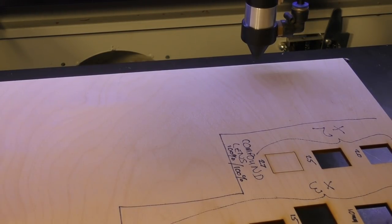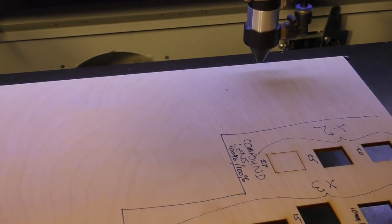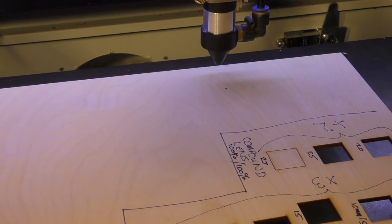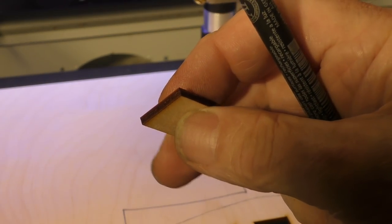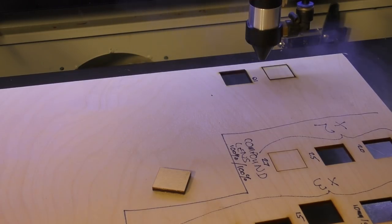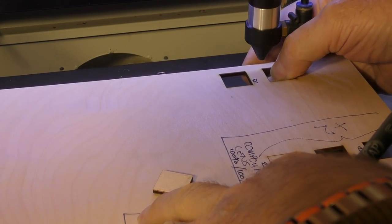So the only other cutting lens I would contemplate using on this machine is a 2-inch lens. And that's what I've got in here now. I've got a 2-inch plano convex. This is normally set to 7 millimeters. And I would expect this to be able to do 10 millimeters a second. I'm getting confident now, because this is doing a bit better than I expected, to be honest. Well, that made it through. It's already a pale brown, so it can't go a lot faster than that. Let's try 12. Well, just about, I suppose.